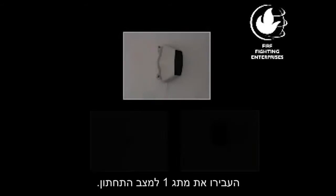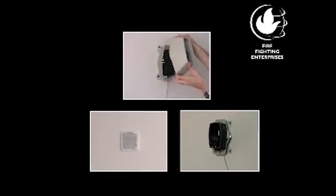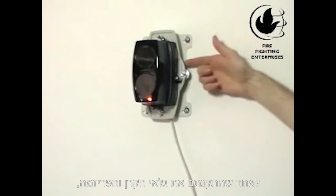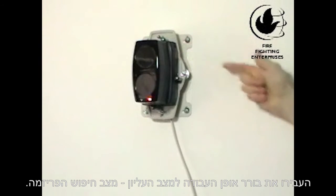The commissioning can be done with the front cover on or off. With the beam powered and reflectors installed, move the Mode switch to the up position, which is reflector targeting mode.